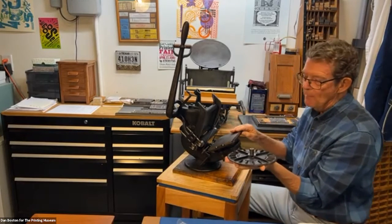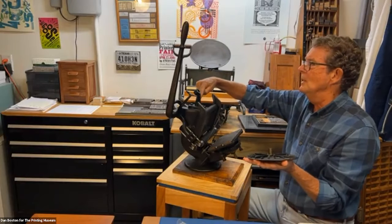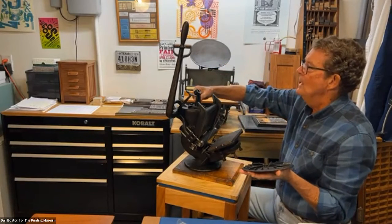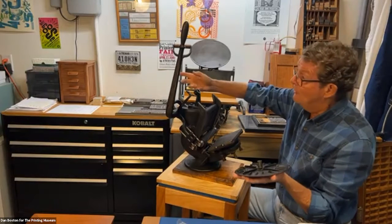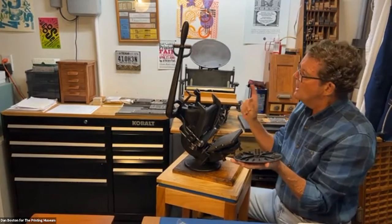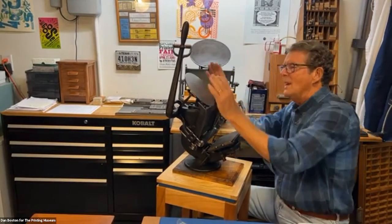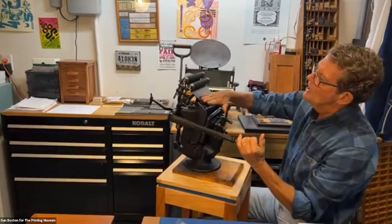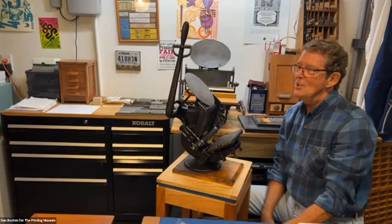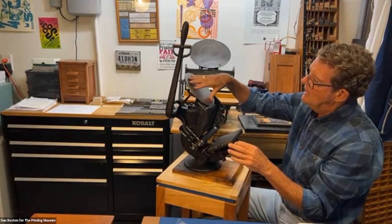I will tell you with tabletop presses, some of them, especially the Kelseys, this is my Kelsey back here. Does this have a name? I just call it bracket. Gooseneck. Yeah. I don't know. Gooseneck, or a little bracket that holds the ink disc. Sometimes they break. And you could find one, especially with a Kelsey, you might have to buy a second press for parts. The caution is that for some of them, they'll machine the bracket and then machine the ink disc so that it is exactly level and the rollers just slide perfectly on it and perfectly parallel, but they're not quite interchangeable. So sometimes you may have to have something machined or add a washer back there, that type of thing. Anyway, that's the second or the third movement.